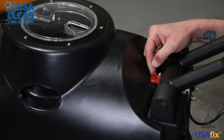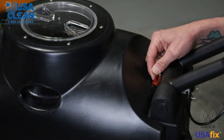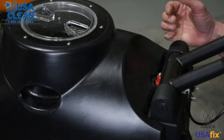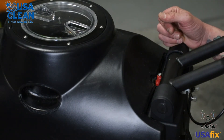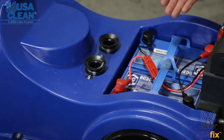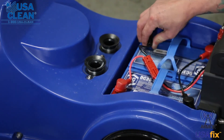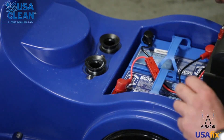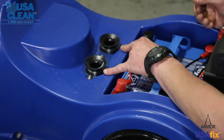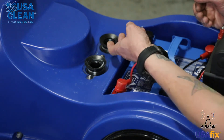On the backside, there's a little red tab right here on top of your recovery tank. That latch and tab just switches over to the side — it allows you to lift your recovery tank out so you can drain it or clean it. When you remove your recovery tank, underneath is your battery compartment. You want to check to make sure that your cables are good and tight and free of corrosion. Also check your two suction hoses and make sure the gaskets on top of them are not worn or damaged in any way.